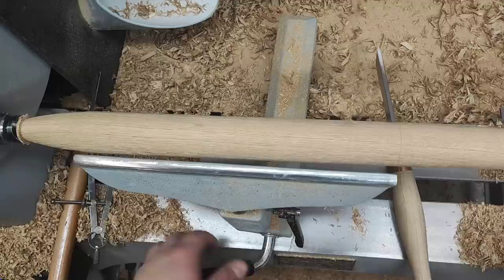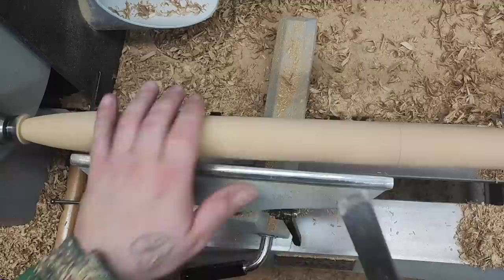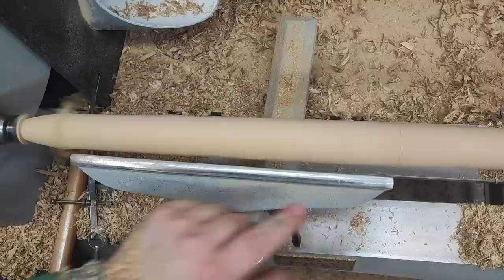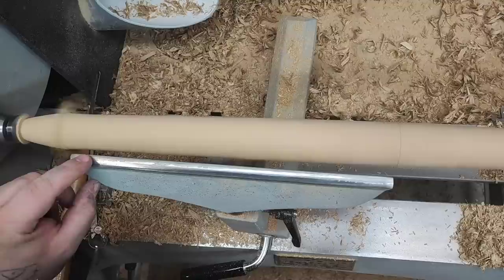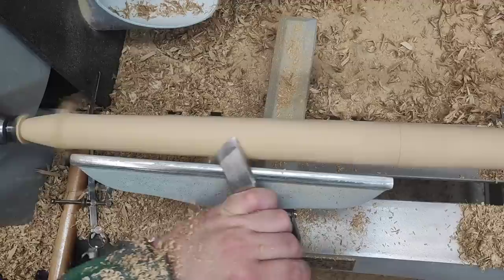So this is approximate. This will move when I take the bulk of it away. So for now, I'll just start to shape it roughly. Now, if you watch the gap, from my angle of view it's a little bit different than from the position of the camera, but here I'm still around maybe even 12 mil, and here I'm around 6 mil. So still need to bring this down. Now I'm getting vibrations. I can slightly tighten it.